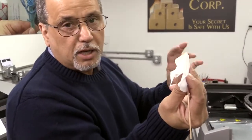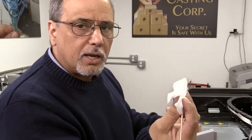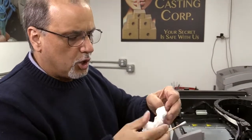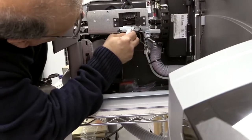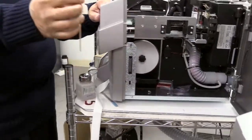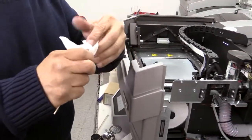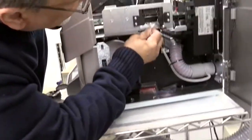That's what I picked up from a fully functioning jet — imagine the buildup that can come on this if you keep doing that. Once you're satisfied it's been cleaned enough, you go with a new q-tip, no alcohol, and come back and ride the rim just a little bit more. Make sure nothing is there. Clean it up real good. We still have a little bit of schmutz — use the rest of the kim wipe. Take your time, do it right. Just come around and clean.